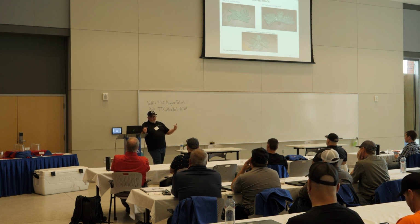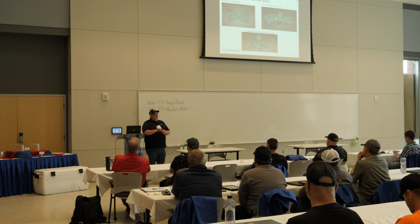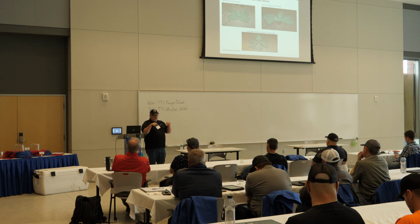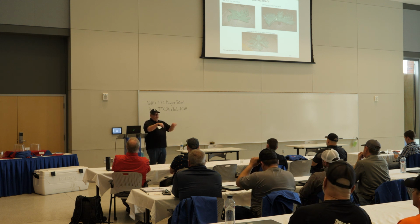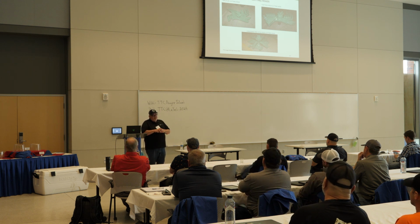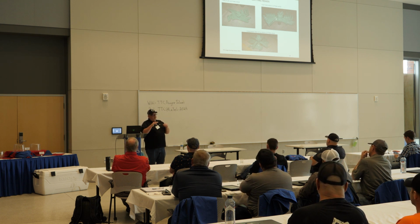The water point through the hex is a 2 or 3 inch hole that goes through the center of the hex. And then we have two different attachments. We have a countersink hole that goes through the bushing, threads into the bushing, and has another that goes into the shank. Or we have the split pin connection. So you're not going through the center, you're going through the sides of your bushings. And we've done up to 7-inch airway hex for that out in Canada. Our auger tube is 12-inch diameter, 1-inch wall.